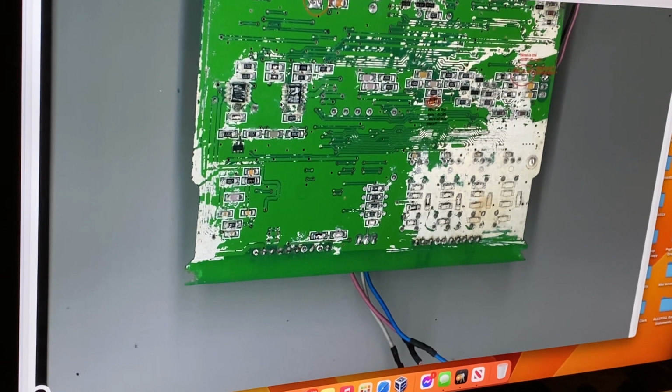Nothing special about those. They only have to handle 100 milliamps or so, probably maximum. That's probably too much, but you can stick a big one in there if you want. You can stick a 3 or 4 or 5 amp one. You can put a 10 amp one in there. It's not going to make any difference. One is the NTM4176 P, which could be a P channel.